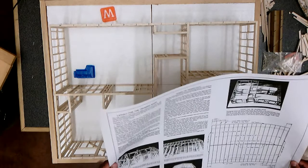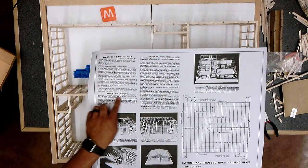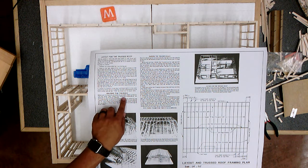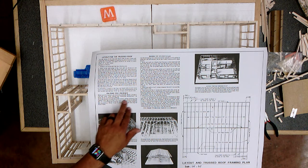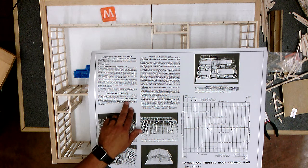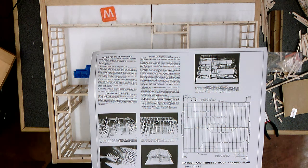Okay, so now that everything is done, so I went here, raising the trusses. Make sure the house is as square as possible. Refer to the instructions number 16 under wall raising, bracing and assembly. On sheet 7, all of the trusses except for the 2 end trusses will be raised up and nailed to the right and left of the layout marks where you place the X. All of ours will be on top of the X's.